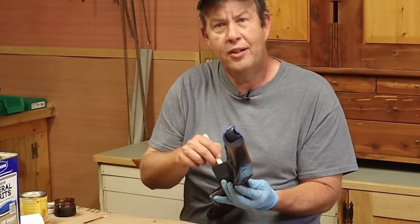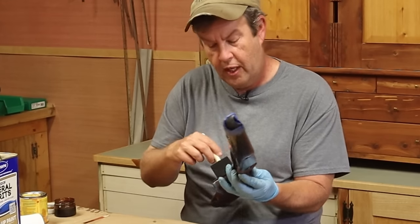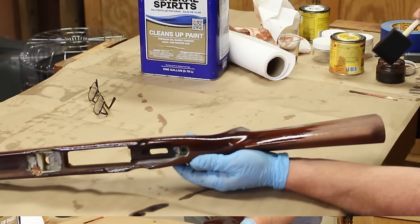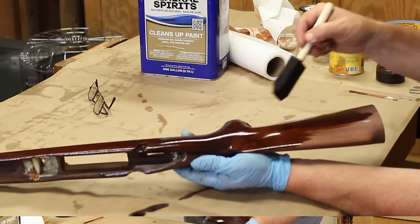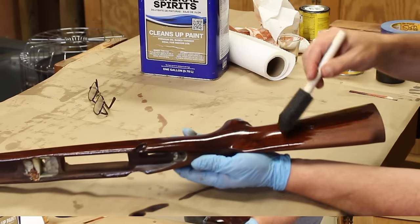When you see some of those custom muzzle loaders that some very talented individuals are still making — you can see the depth in that finish and they're just gorgeous — it's because they've often used a light coat first and then gone to a darker coat, working their way to that final finish. I think us starting with the gun stock and then working to this final coat is going to give us a lot more depth on the finished product. Now we're getting that really nice, rich, deep red that just looks so good on a rifle stock.